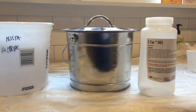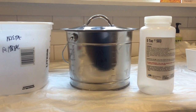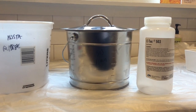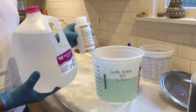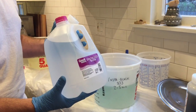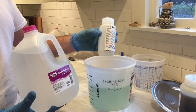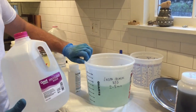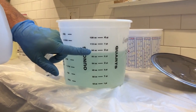This is what gives the most protection to your part. The part is immersed for only a short time, but the sealant is left on — it's not rinsed — and the part darkens as the surface absorbs the sealant over the next 24 hours. The products are shipped as a concentrate, so you need to add water to them. I've gotten some distilled water so that I can have the purest solution, and you can use the original bottle as a measuring tool to mix it at the 9-to-1 or 4-to-1 ratio as needed.